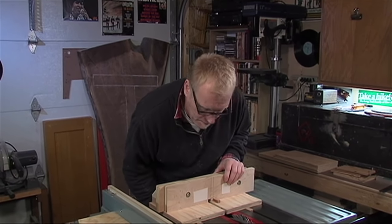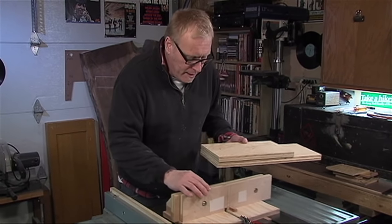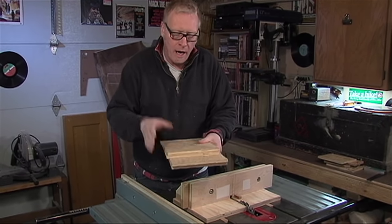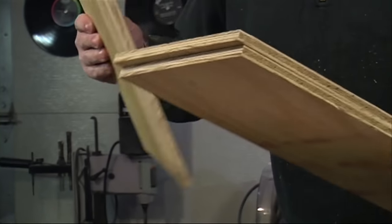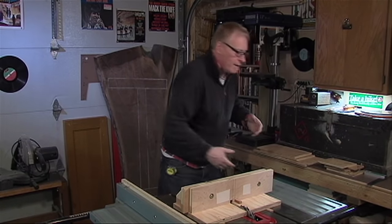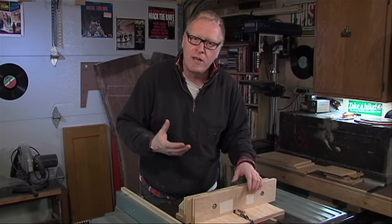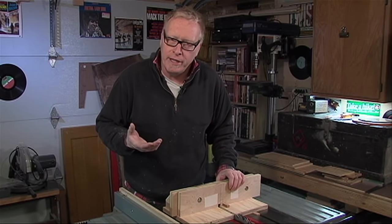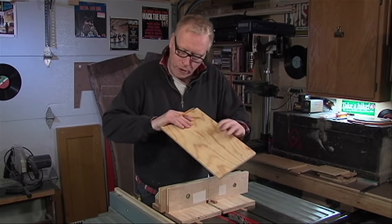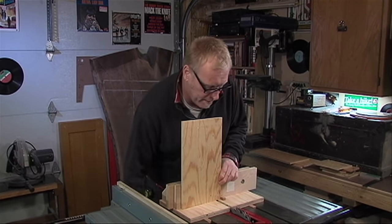I think we're good to go and cut our proper pieces. One thing you have to watch out for — set up the boards the way you want them and draw a witness mark so you know which side to cut. Also watch the outside and inside of the box. There's going to be a little tear-out, so go slow. If you go too fast you get more tear-out; if you go too slow you can get some burning — so it's just a happy medium. This is fir plywood, so both sides are pretty much the same, but I like that side better, so we're going to have that side out. And here we go.